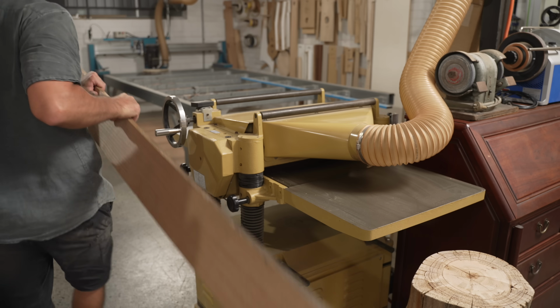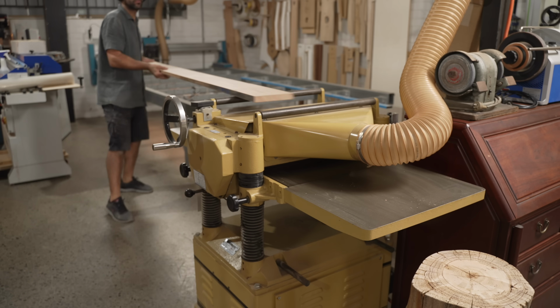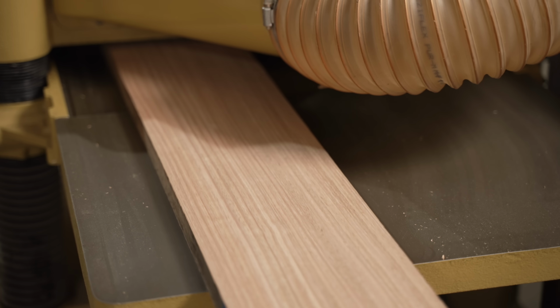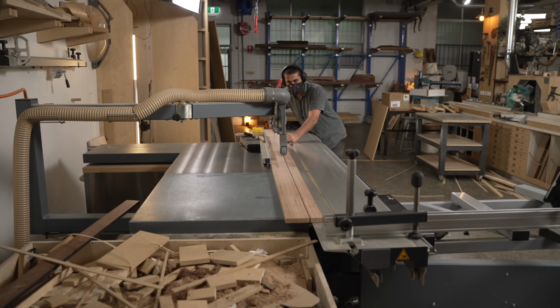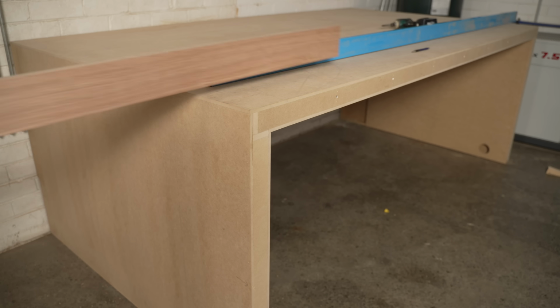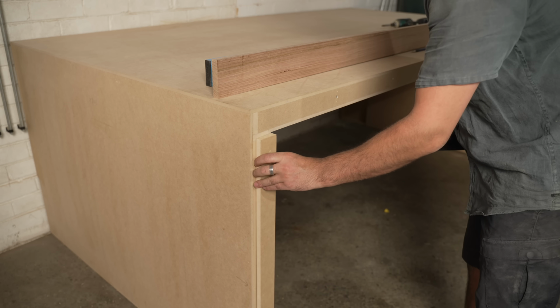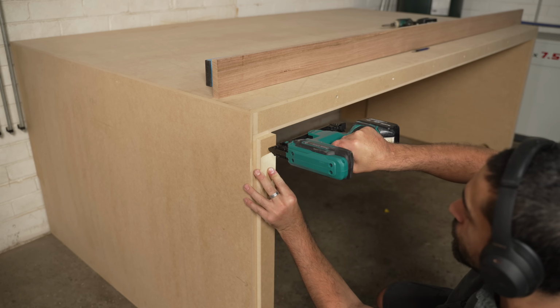I'm going to put the wood under tension in order to counteract the dip in the bench top. This wood is Tasmanian oak. The straight grain in this Tassie oak is important for this idea to work as intended. Another important part of this process is these temporary MDF strips that will allow the wood to rest on while I begin clamping.